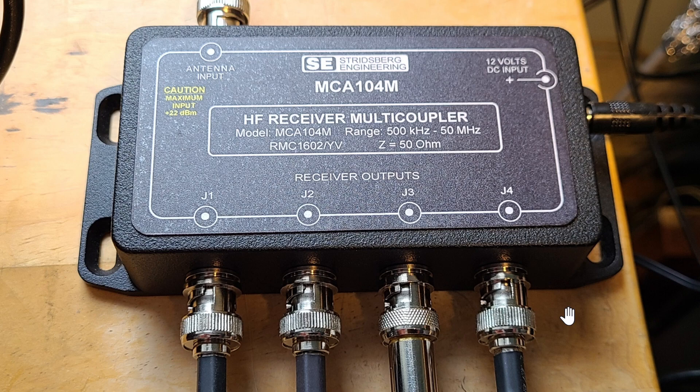There are much cheaper models with isolated ports that work well. Passive means there's no amplification, no electronics driving the signal — the signal just goes in and is divided into multiple ports. There's no filtering, no processing, no amplification of the signal in any way. These passive splitters are much cheaper and work very well, honestly.